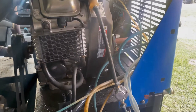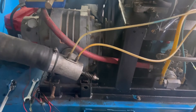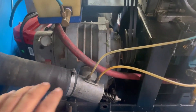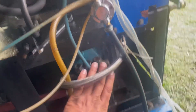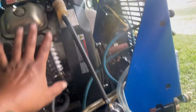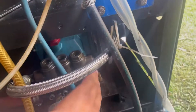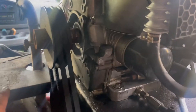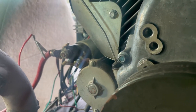For anybody wanting to know what happens when your carpet cleaning machine breaks down — this is my main unit, this is my blower, this is my chemical pump, this is my water pump, this is my engine. My engine has gone down. I'm getting ready to loosen up my pump, take this belt off, unbolt these four bolts, loosen up this blower so I can get these belts off, undo the electrical right here on the solenoid starter, and pull this engine out.